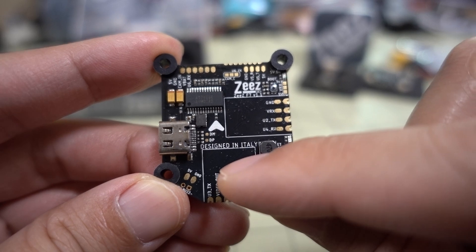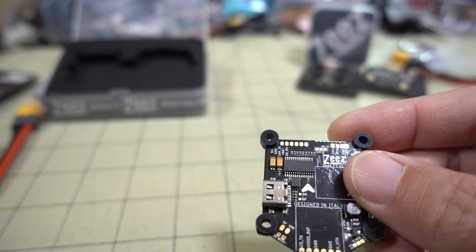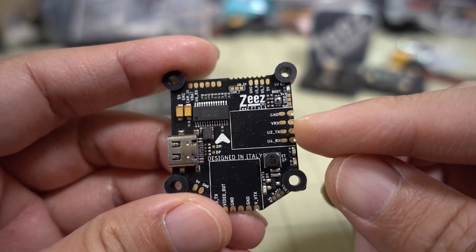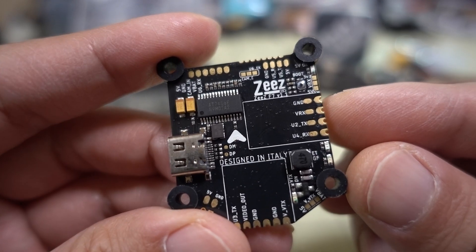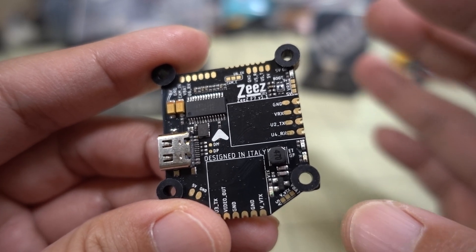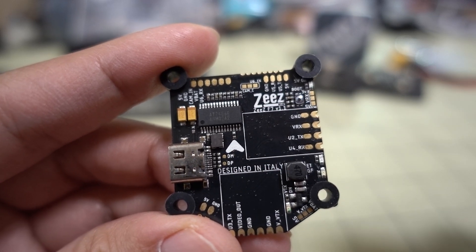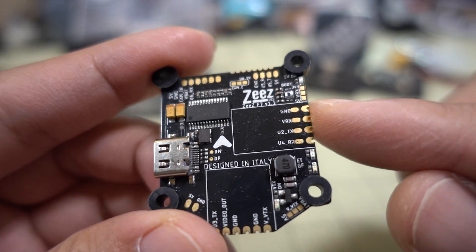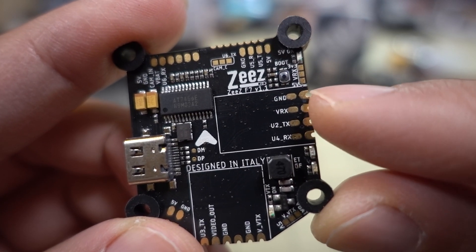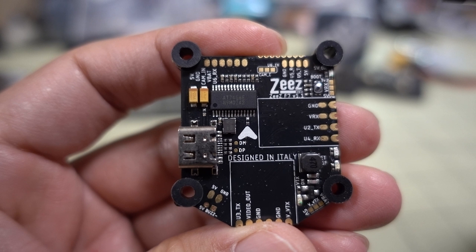There's empty space here for your receiver and video transmitter. They kind of designed this around the Crossfire Nano and the Unify Nano. You can use the included pins if you want to wire up the receiver permanently, but I would recommend not using the pins — they're not easy to solder on properly even with decent soldering skills. Instead, I'd recommend using very short wires and using some VHB to stick the receiver on the flight controller. It'll still maintain a very low profile without the problems of the pins. There are also pads available on the inside for ground, receiver connection, and your two UART connections.